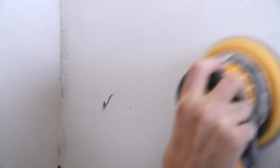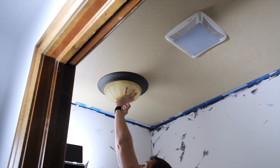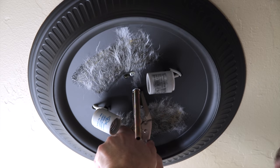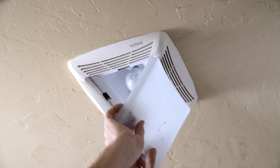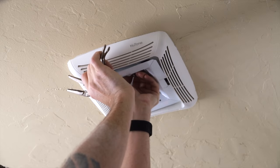Getting back to the house and those bathroom walls — that joint compound had fully dried. I expected needing to roll on another coat or two, but the walls turned out really smooth and were ready to paint. In preparation for painting I removed the light fixture from the ceiling, which I'll replace later, and also removed the bathroom vent but decided it was in good enough shape to keep.